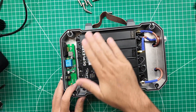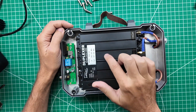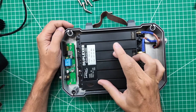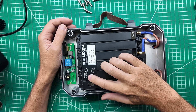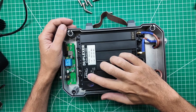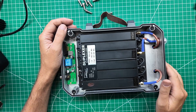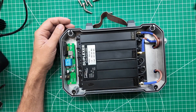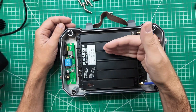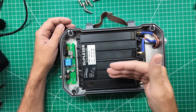That's what I was expecting to see. This is why you'll see GMRS repeaters and 70-centimeter repeaters. This one is from 462 to 467, but we're going to be able to open this up and — because we're hams, legally — turn it into a 70-centimeter repeater. This is a duplexer — JIESAI or JESAI, I'm not sure. What this does is it keeps your low-side frequency separated from your high-side frequency so that you can use one antenna with two frequencies, transmit and receive, without transmitting and receiving the same frequency into the radio system and blowing up the front end.